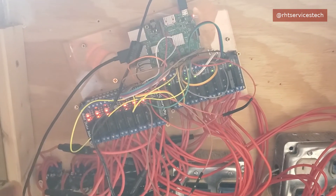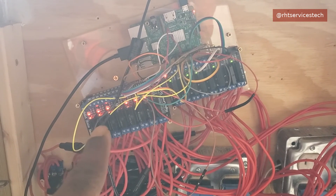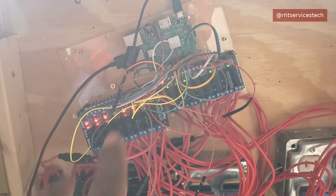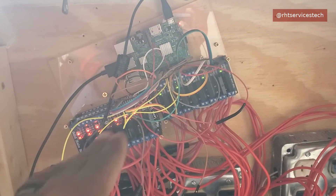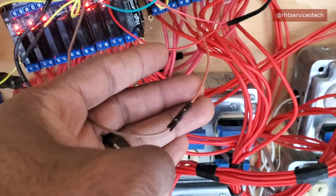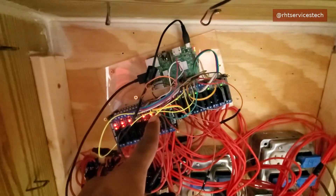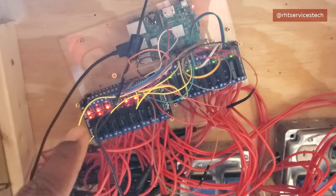Somewhere in the off season I did notice that a short developed in the breadboard wires that are used to connect the GPIOs on the Raspberry Pi to the relay boards. I'm not sure where that short existed but I know it existed. Because some of those wires had shorts I just redid the whole thing. I took all of the breadboard wires off and brought them down to single wires, because in some places I had double wires due to the length of wire that had to be run. Making them single wires practically eliminated the shorts on the control side of the lighting.